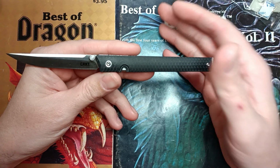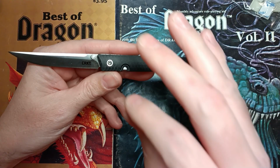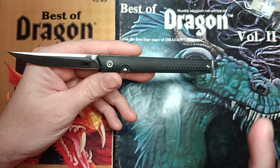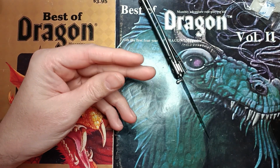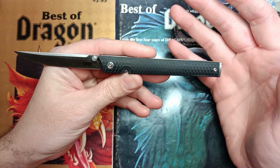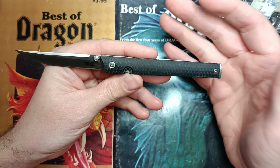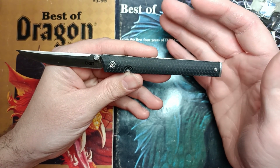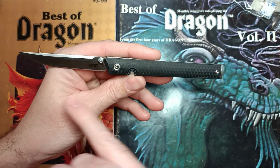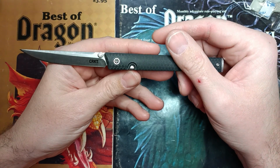And that's what we're getting on these CR series steels. Okay, your first hour, the really fine apex goes away. It's still cutting strong. It still does copy paper well enough, you know, all the things. And then at the 2-hour mark, it's still going about the same. At the 3-hour mark, you start getting a loud cut on the copy paper. And getting towards the 4-hour mark, you start seeing where it's got worn spots that hang up on that cut. So that was about what I expected out of it.